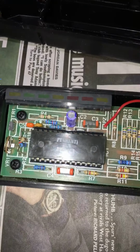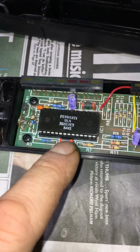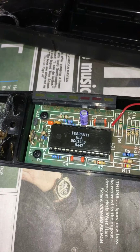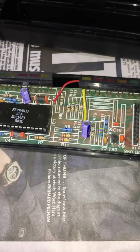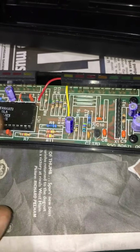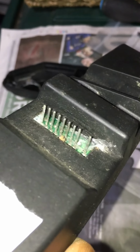So yeah, normally take it out carefully, and sometimes I found that the pins are just dirty and cruddy. Clean them all off with contact cleaner, clean the holder gently with a toothbrush, clean over the whole board, contact cleaner it, clean over the back, and often doing that and replacing anything obvious such as the R21 often sorts it. On the pins, be very careful of those. Make sure that they're clean. This one does actually look quite clean other than the actual cobwebs.